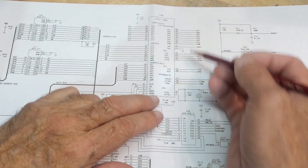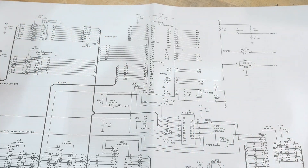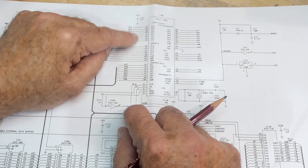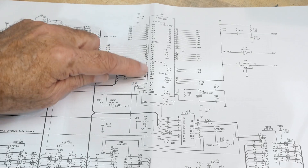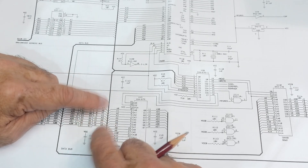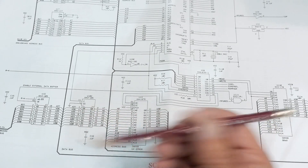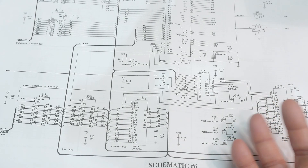Let's take a look at a schematic. Here's the HC11. It has its address coming out here, but wait — there's no separate data bus. The address and data are multiplexed together on these eight lines. The upper addresses come out normally, but the lower addresses and data are shared. So you need one latch to separate those two, a lot like an Intel-type product. The latch right down here separates the address and data, latching just the address space, and then the data can go other places. Here's your ROM, here's your RAM — and that's basically it. You just needed to add a latch, ROM, and RAM. You also needed some logic to handle memory mapping.